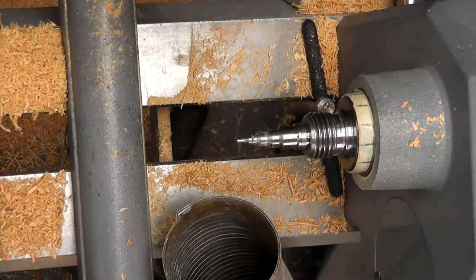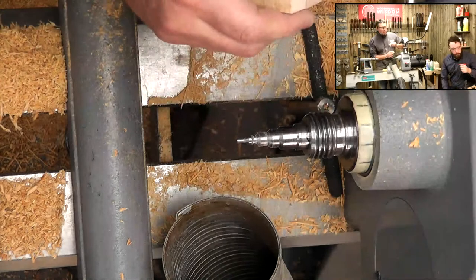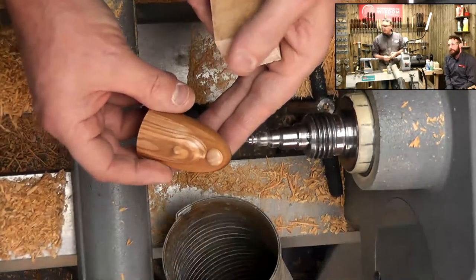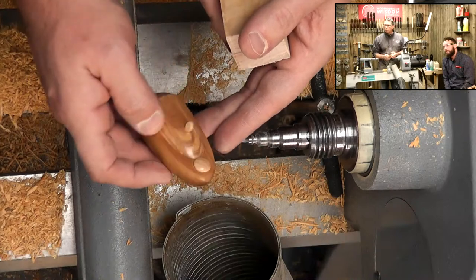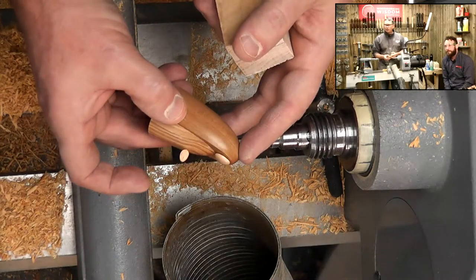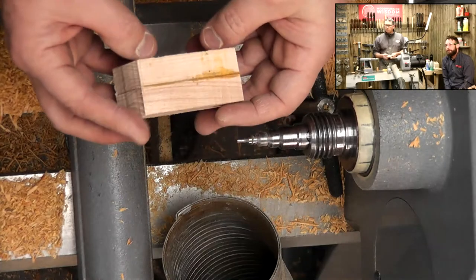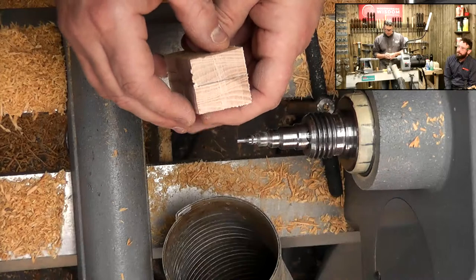The only thing we've got left to do now, I want to do the front face. Could you pass me Mary there, Ben? The front face of Mary. So look at this. This is two pieces here. The bit that we've already turned is the back, her shawl. And so we just want to turn that front face. Rather than sanding all of my turning away, look, what I've done is just done a little glue block. So we're just going to turn that into a similar shape. No need to drill this one because we're taking most of this one away. So a little glue block.